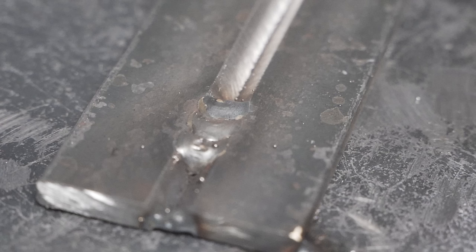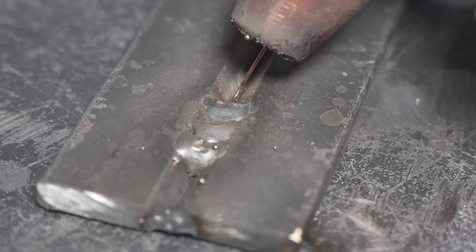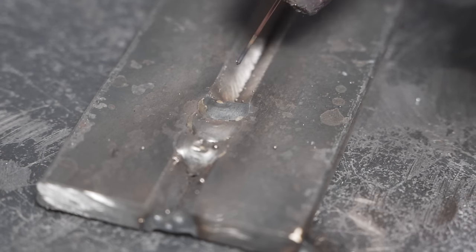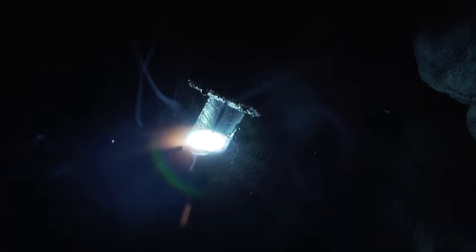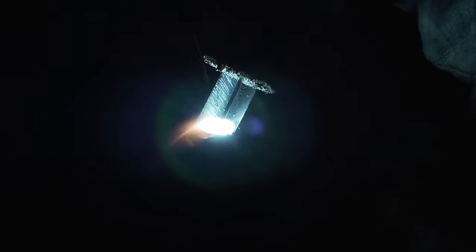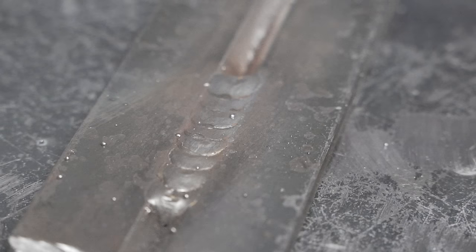Now we're going to speed things up. We're still making individual spot welds, just not stopping to talk after each one. Starting at the back edge of the last weld, squeeze the trigger, fill it up, stop, then relocate to the edge of that last weld. Squeeze, fill, stop, relocate. Do that for a while and get used to that rhythm, practicing quickly moving from your current weld to the new position. What you're doing now is stitch welding. This is acceptable and often necessary on thin sheet metal, but on thick metal like this, you're not getting enough heat to get good quality penetration.